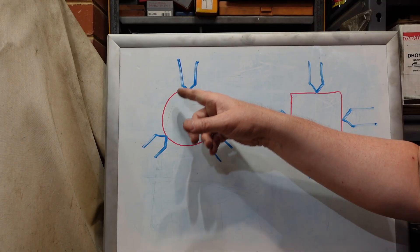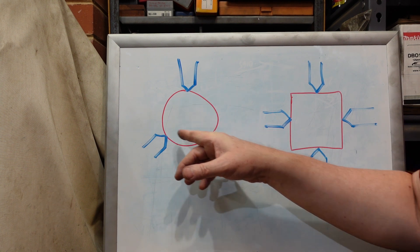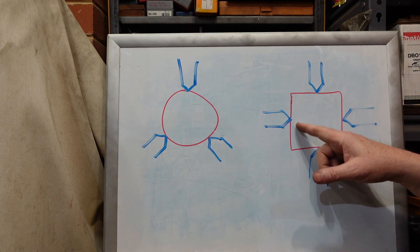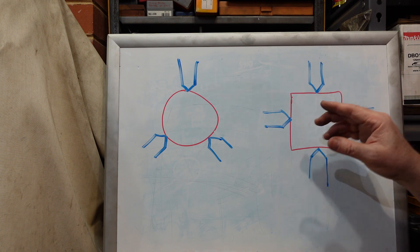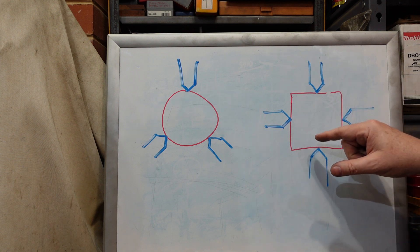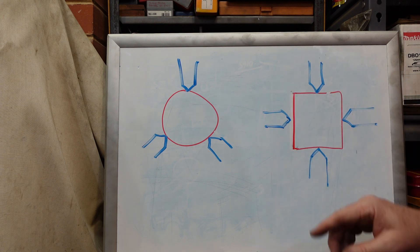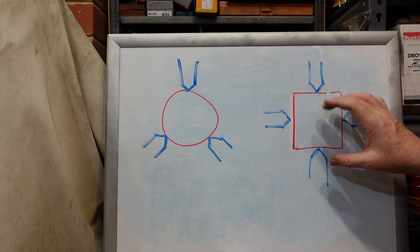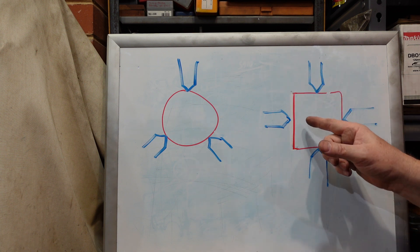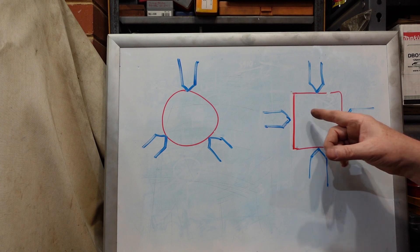This is the basic problem. When you've got a three-jaw self-centering chuck it centers around a round or hexagonal piece of work quite nicely, because three jaws define the surface of the cylinder. But when you go to a four-jaw, unless the material you're holding is exactly - and I mean exactly - square, these four jaws come in together, assuming there's no errors in those jaws, and they will meet up only if it's exactly square. If the material isn't quite square, two of the jaws are going to clamp and stop the scroll moving while the other two still have some way to go, so you end up with a couple of the jaws not working.